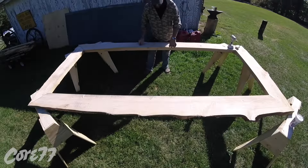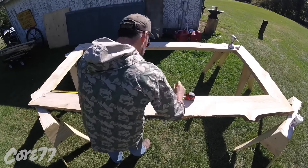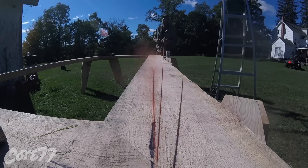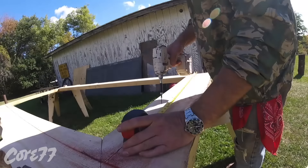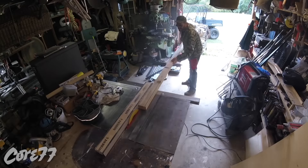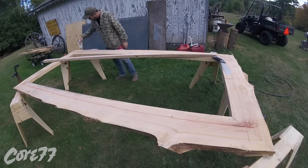I say chalkboards because I was given two chalkboards to put into this frame — two slate chalkboards, three-eighths of an inch thick. I'm marking the center of my long side, which is right where the two chalkboards are going to meet, and marking my center on the short side. I use a chalk line to lay out the perimeter. Then I check the squareness of the frame using the 3-4-5 right triangle method: if one side is 3 and the other is 4, the hypotenuse should be 5 feet — and it is. I double-check with my diagonals to make sure they're the same number. Now I begin cutting the pieces of wood that are going to trap the boards — three-eighths of an inch slivers from 2x4s — to make up the exterior edge of the holding area that carries the chalkboards.